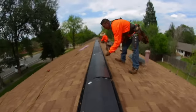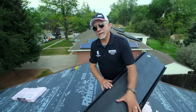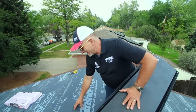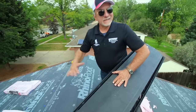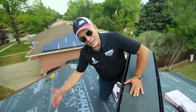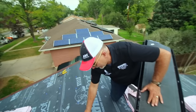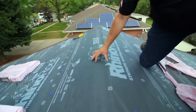Take a look at this video — hopefully we can help you. In the process of doing this roof, we're going to be installing a ridge vent for 40 feet across the peak of this one-story ranch home. Right now we've got everything decked all the way up. We've got the ice and water in place, and we've got the underlayment up covering the peak right now simply because the skies are showing a threat of rain. What we have here is a three and a half inch opening right across the ridge.